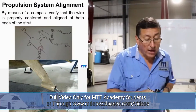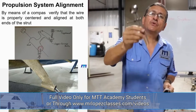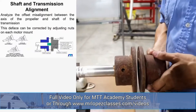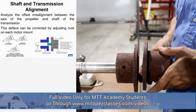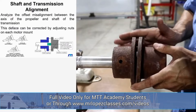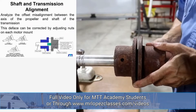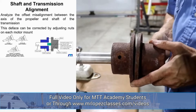When we pass the wire through the center of the strut, we are going to use a metallic compass. This is the transmission and now we are going to align the transmission and the engine. We are going to verify that both couplings are completely aligned and that the surfaces are completely parallel — not angled like this, not offset like this.